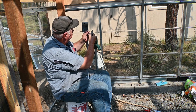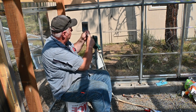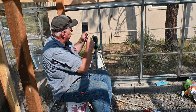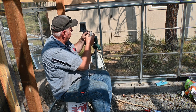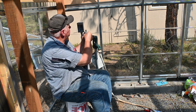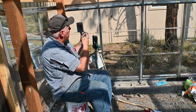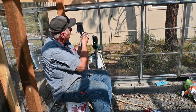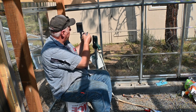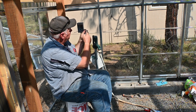And then this ground. Of course, the ground doesn't have a shielding. The black, or the hot wire, is the one you need to be concerned about. But, and behind this ground is a white wire, or the neutral wire. And neutral, you need to put some emphasis on caution. But for right now, I'm trying to get the ground out, and I'll go get a pair of pliers or a pair of electrician pliers here in a minute.